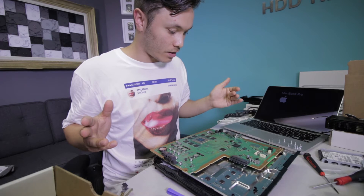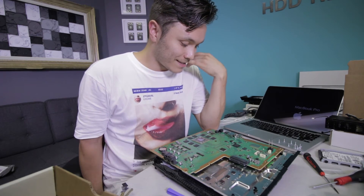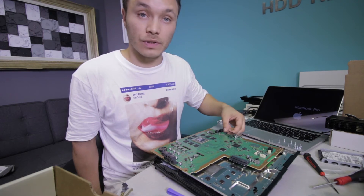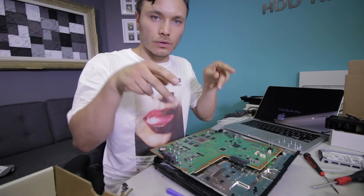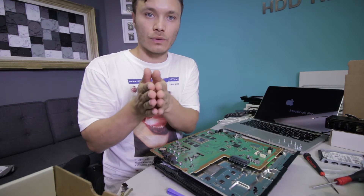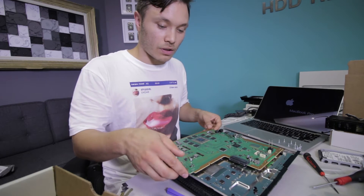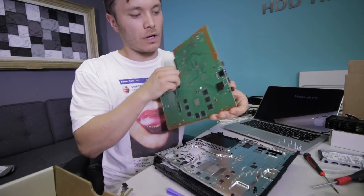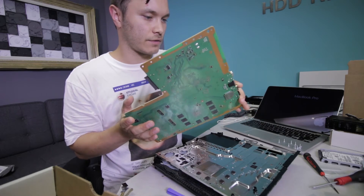The connector wasn't all that great when it went into the anchor holes — it did not seem like it aligned with the pads correctly. I just had to bend the actual anchors to the sides so that it would offset the position to line up the pins with the pads. It worked out pretty good as you guys could see; the total connection is solid now.